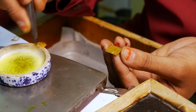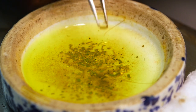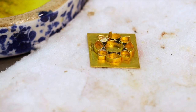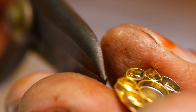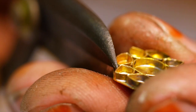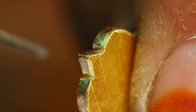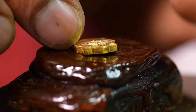Flux is applied as well as small slivers of solder. The parts are then soldered together, the excess gold sheet is snipped off, and the surfaces are filed smooth and lightly polished. The component is now passed to the engraver, who secures it in shellac.